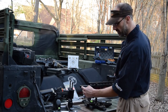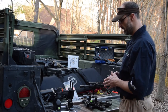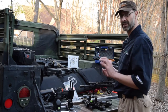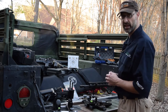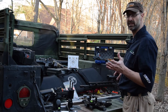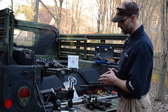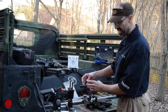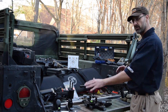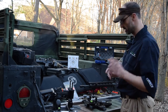This muzzle brake is a three-port design for a .223 caliber rifle — typically an AR, or any .22 caliber rifle with half-by-28 muzzle threading, which is what this comes in. The external coating finish is a QPQ, which is a salt bath nitride. That gives you pretty good corrosion protection, which is important because you get a lot of hot, nasty, burning gunpowder gases on this that can cause corrosion problems. This is called the Gunner, and you'll find it at Faxon Firearms with a link in the description.